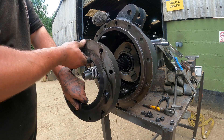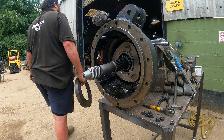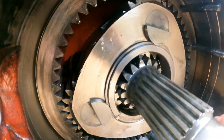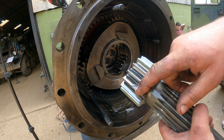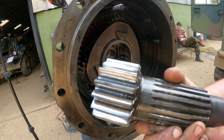It's now got the brake assembly off — once we clean that up I'll show you how that goes together and how that works. We've discovered some more damage: I've got teeth laying there, I've got a whole tooth missing here, teeth missing all over the sun gear and all over the spider gears. We pulled this shaft out and you can see we've chipped here — chipped a lot of the ends — so that is going to need replacing.